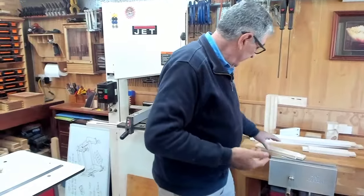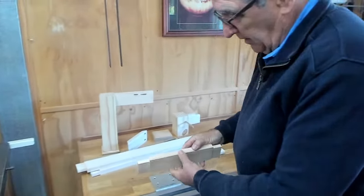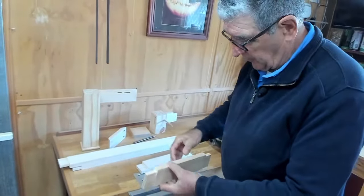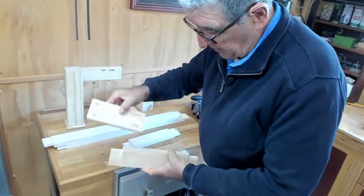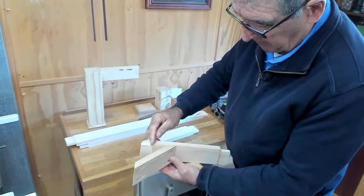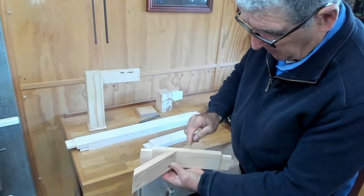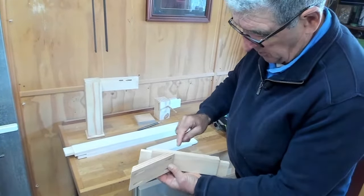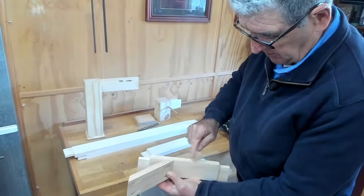So to do that, here's what we're going to do. What I've got here on my rails, I've got my two top rails for the sides and my two top rails for the ends. The distance that I have here is not very much, and when I put this into here, as you can see, we've got one there. That's where it has to go, 75 millimeters from there to here, and the same with that from there to there. Depends on how long you make that, depends on where this measurement's going to be. So I don't have a lot of room where I can put a button in, so I have to find the center. So it's important to dry assemble, get your measurements correct, and then set up where you're going to put things on the rail.